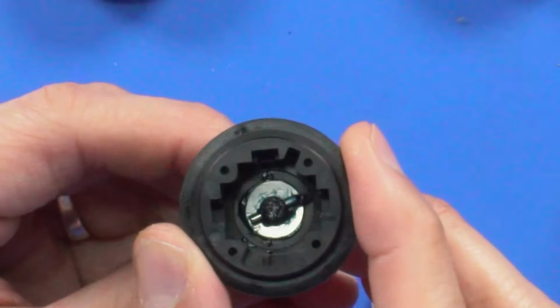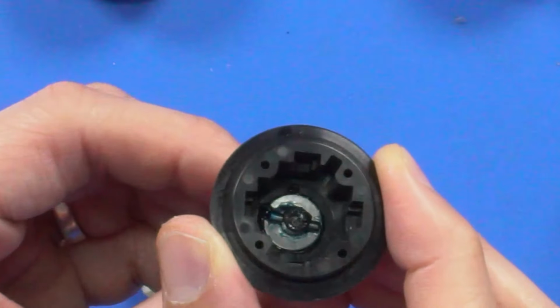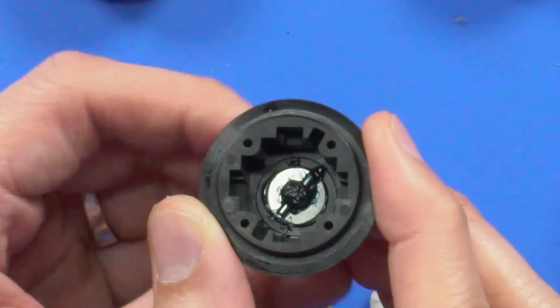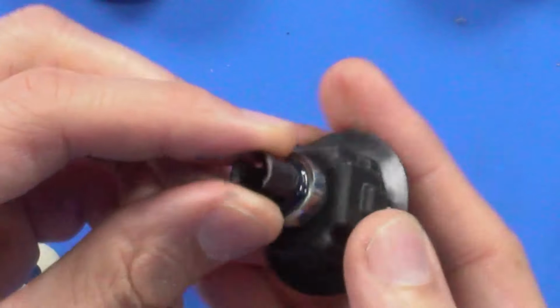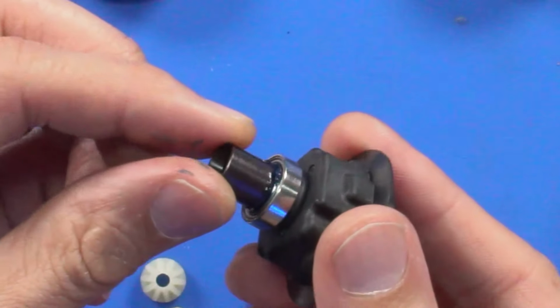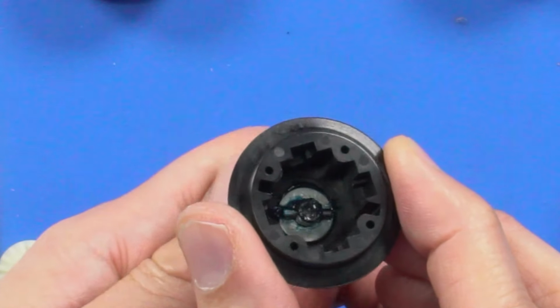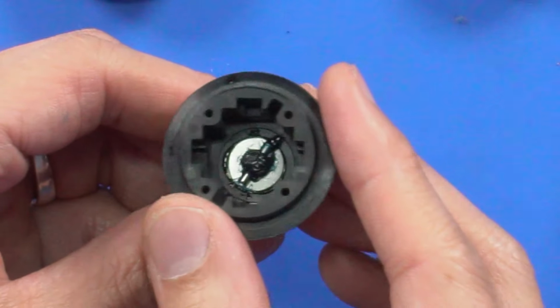So there you go. We've got the pin in there. It's just sitting on top of that big shim. Now that grease you can see, that's the rubber grease that we've used, just for the assembly. So that's for the O-rings? We've got that on both sides. That helps generate a seal, and also protect the O-rings from the silicon oil itself. Because silicon O-rings will expand, won't they? Yeah, they'll expand.